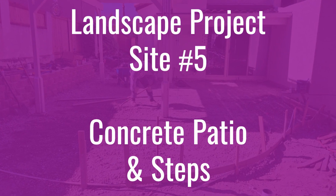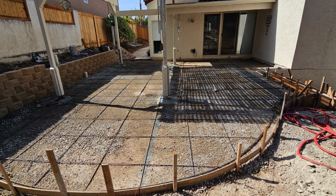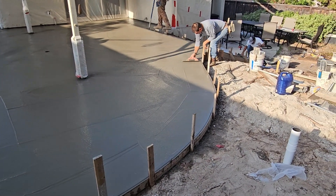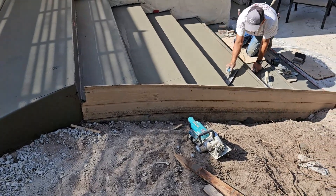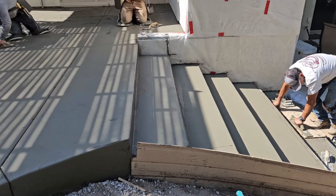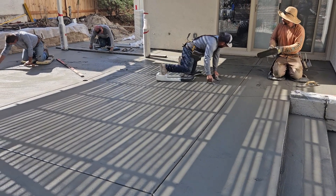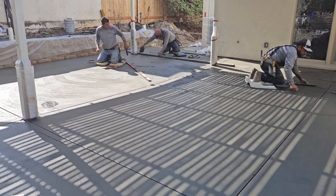Number five: a backyard concrete patio. Because the soil is a little softer, they did a crushed road base underneath before pouring. The concrete was poured and they're doing all the floating now — with a nice little curve, of course. I curved the patio and even put a curve on the steps. The guys are doing the final finishing, including the expansion joints — really important so the concrete expands and contracts and cracks along the joints rather than in the middle. There's also a little drain in the middle to keep water flowing right to it.